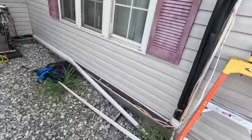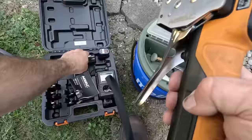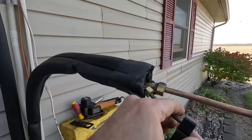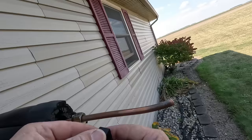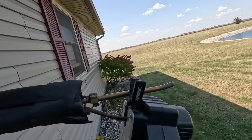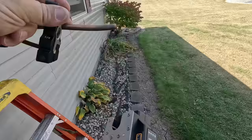I bought this deburring tool here — it doesn't work super great, but it does work. Okay, we'll go ahead and get our flaring tool going. There's our quarter inch and there's our checker. Sometimes you got to adjust it when you go from one extreme to the other. This makes it brain dead. So for those rookies that haven't done it much, and if you're going to put the rookie out there doing the fittings — which is what most lead installers do because they don't want to do it, and then the whole thing leaks because the kid didn't know what he was doing — this is a perfect device for him. Lock it in, hit the button. Can't ask for dumber and more brain dead than that. Perfect flare.